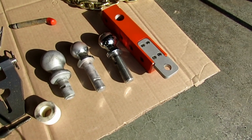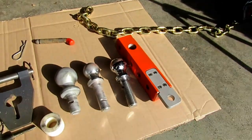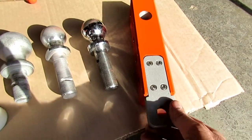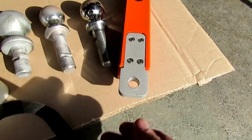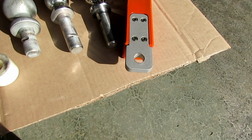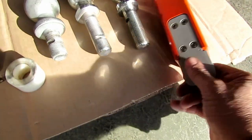This is a video of a hitch that I made for my little Kubota BX series. It started out as a 2x2 piece of aluminum bar that I machined a little pocket out of, and I inserted a half-inch piece of stainless steel to be used for towing — things like a yard sweeper, lawn roller, or anything that requires a pin-type hitch. So basically it's just an aluminum hitch receiver.